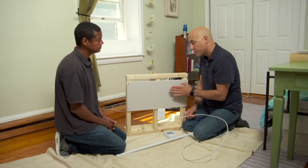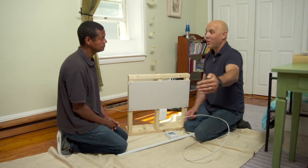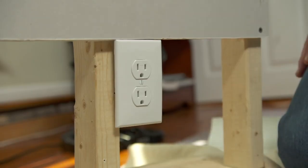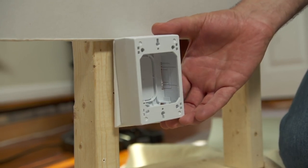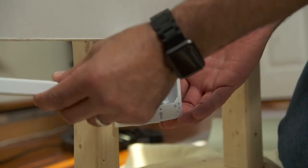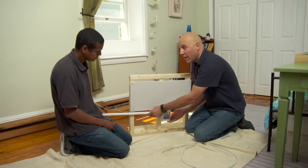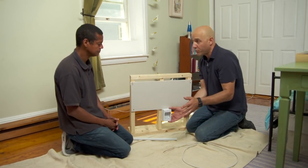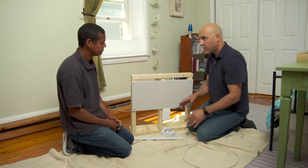Sometimes what we do is we notch out the drywall or the plaster, drill out the stud, and go between them, one to the next, all the way around your room, so you'd have a bunch of patches and it wouldn't look great. Another option is this surface mounted box here. We would add it to the power source, and then we would take this raceway, go right on top of the drywall or plaster, and this raceway would go around the entire room. If we came to a doorway, we'd go up and over it, and everywhere we need an outlet, we drop down into it. It's an okay solution, but not the best in your case.